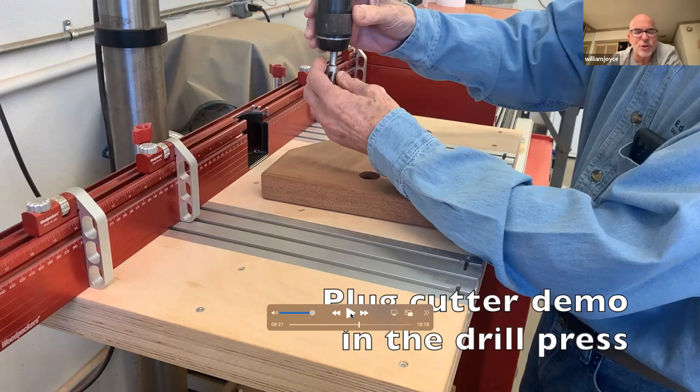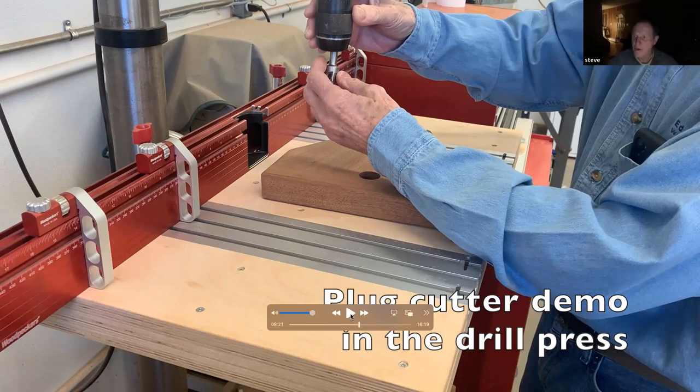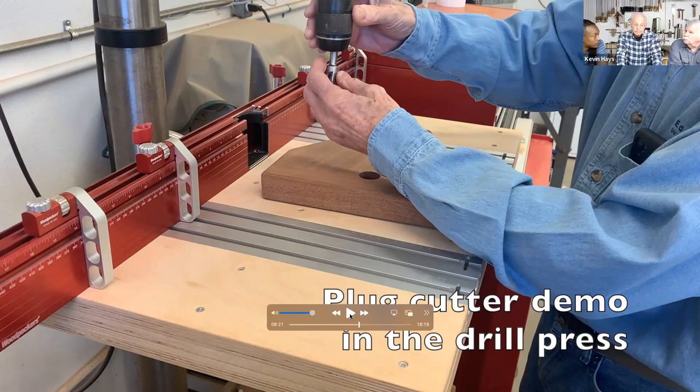So in a nutshell, torque is basically twisting force. Yes. Also, when you're using these big screws, put wax on them. It makes the screw so much easier to put in. Yeah, wax, soap, Ivory. It makes it a little easier to come out, too.